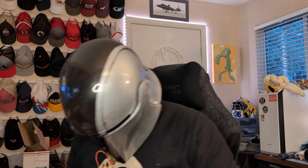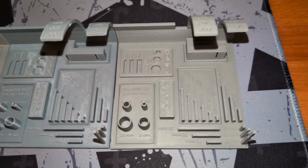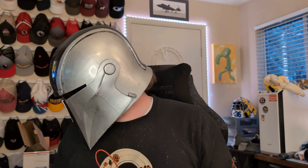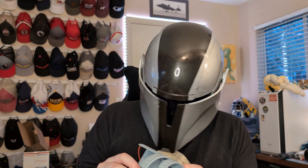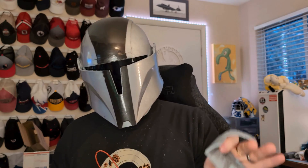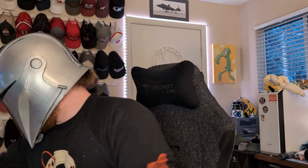The other thing — it's kind of hard to tell on camera — but a lot of them came out almost like a yellowish gray, whereas the Rapid PLA came out like a steel gray. The standard, Pro, and Plus were all that little yellow tinge, whereas the Rapid was like a steely blue-gray, and I personally think that looks a little bit better. In terms of layer lines or extrusion issues, none of them had anything like that — no ghosting differences. The Rapid also had a little bit less stringing, mostly between the towers. The standard actually had less stringing than the Pro and the Plus, and then the Rapid had just a little bit less.